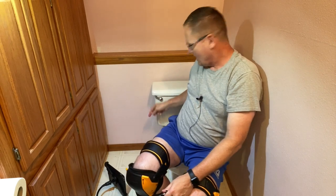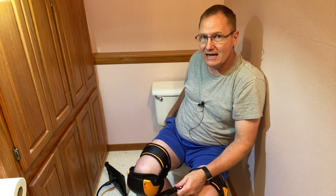The bottom of the mounting screw is rubber, so there's no way to grip it with anything but your fingers — they do that so you're not going to over-tighten. Porcelain toilets are really easy to over-tighten and crack. One spot is down at the floor mount, and the second is where the tank and the lower part meet — over-tightening those nuts can crack the tank. So the design here lets you use your tool on the Phillips side to tighten, compressing the rubber to act as a holding mechanism for the mounting plate.